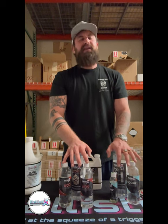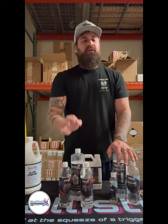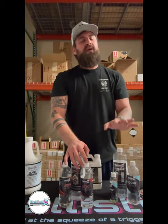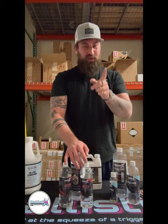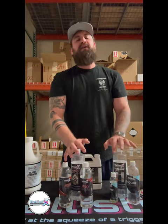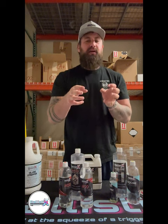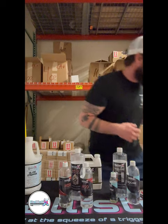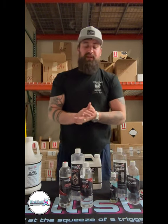This product was sold over about a million square feet of flake this year. It's put down over polyaspartic and is a great upsell to flake jobs. This costs you as a contractor about 30 cents a square foot, and the added protection value is around $1.50 a square foot over your flake jobs. If the polyaspartic is not slow cure, it can be put down as soon as the recoat window has closed. For flake installers: check your recoat times on your polyaspartic, but most importantly, go in selling Ballistix as an option. This product is going to protect against petroleum, coolant, acids, and all the things in your garage that can wreck a flake floor. The homeowner can also put this down — it's simply that easy. It goes in a simple HDX pump sprayer and is extremely easy to apply over flake.